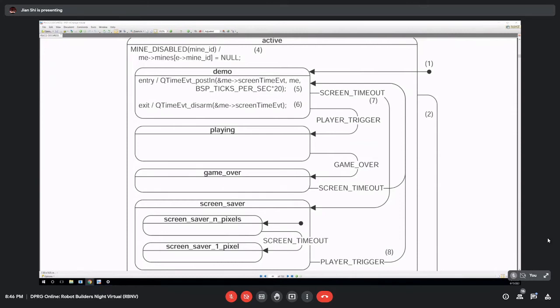John, there are real fast ways to implement those in C, because you can have pointers to functions in C, so your state vector is basically a pointer to a function, and the way you change states is by changing that vector. So it almost maps straight to the hardware. I think that's one advantage. One of the advantages of the state machine is the flexibility. It's a data-driven algorithm that allows you to transition from one state to another without having to code the logic within the loop that you're executing.